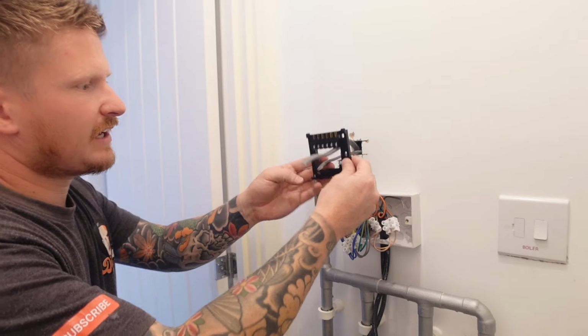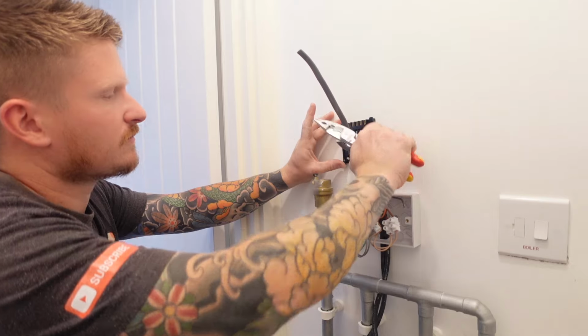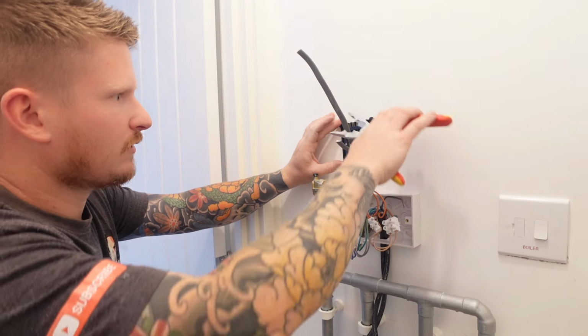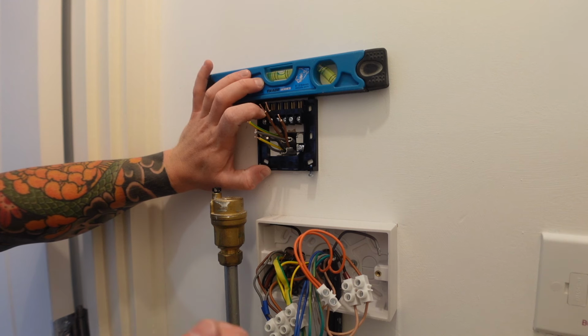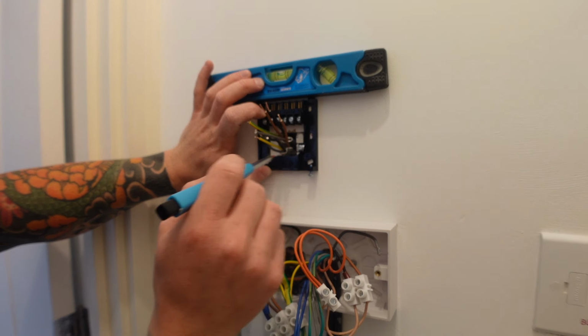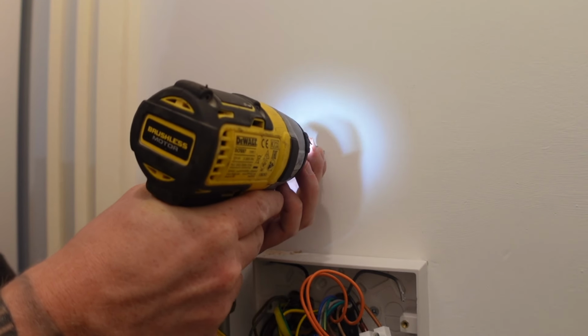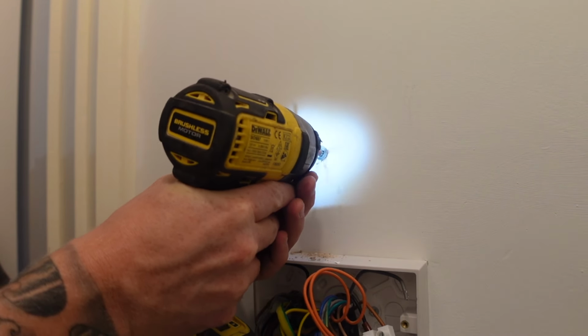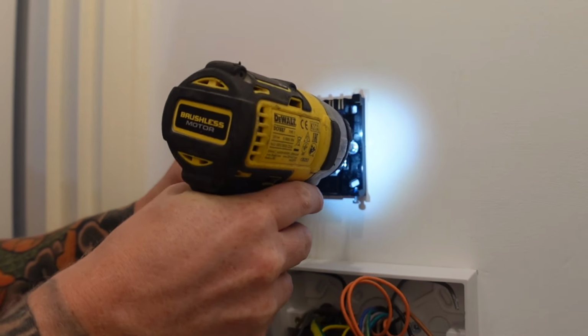Now I've extended those cables, I can think about mounting my back plate. I'll just cut these cables because of course at the moment they're too long. Now I'm just using a little torpedo level. All the handy tools for this job will be linked in the description, and I make a couple of marks for my fixings. I'm then just using some plasterboard fixings. These are self-drilling fixings to mount the plate to the wall.